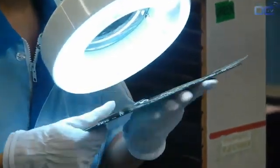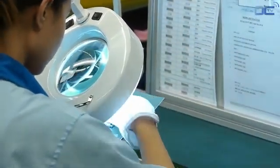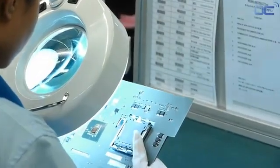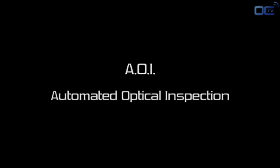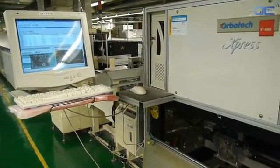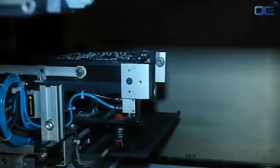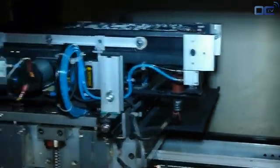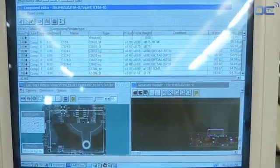Your mainboard now has all the small resistors, as well as the chipset and the socket. It's time for the visual inspection, which avoids any misplacement or missing parts. Components smaller than 2mm can't be checked by humans, but the AOI — Automated Optical Inspection machine — is there for it. It checks if there is any missing or misplaced component, and also checks all components with visible soldering points, like the audio chip.